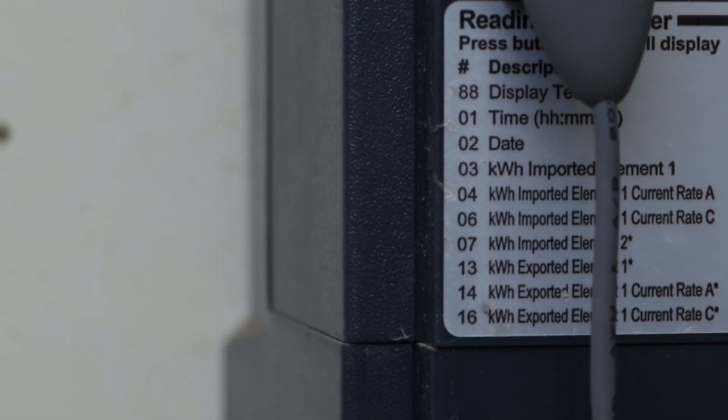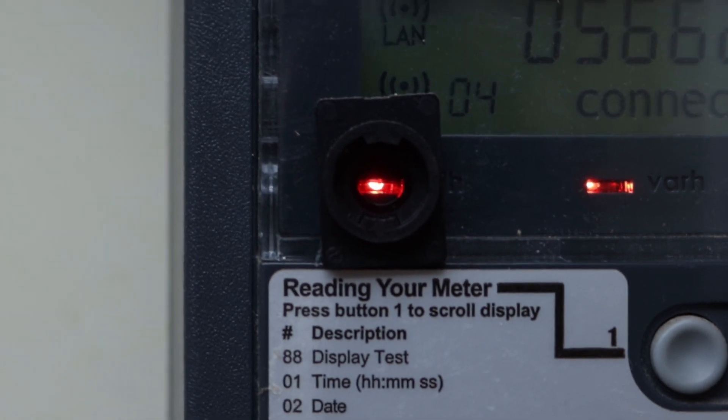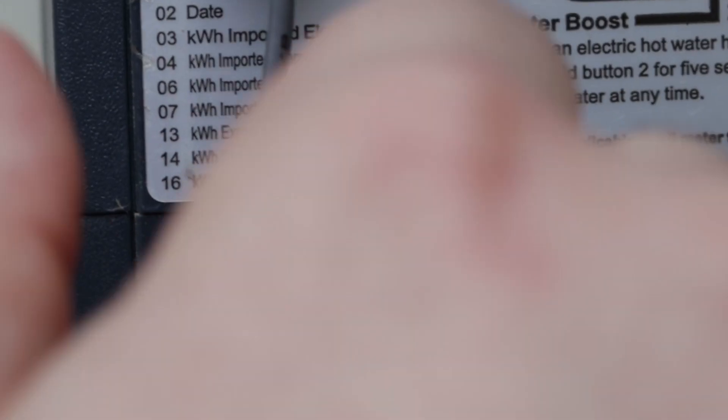So let's start by talking about what it is. It is just this tiny little unit that sits on, in, or near your meter box, and it has a small sensor at the end of a cable — I'm pretty sure this is a photodiode. This photodiode sits over the flashing LEDs on your smart meter and counts those flashes to figure out how much energy you're using at any given time. There is a companion app so you can visualize your energy usage and get reports. The PowerPal connects to your mobile phone using Bluetooth low energy, which means it doesn't connect directly to your Wi-Fi network. The unit can log up to 90 days of data, which can then be exported from the app to a CSV file.